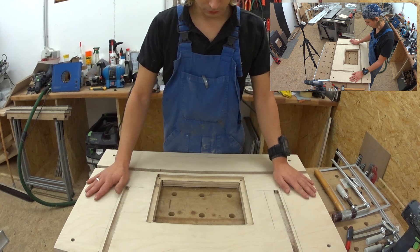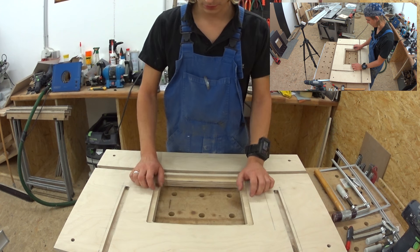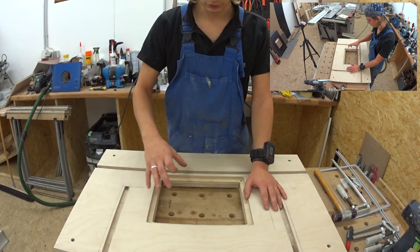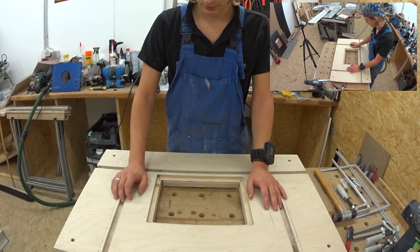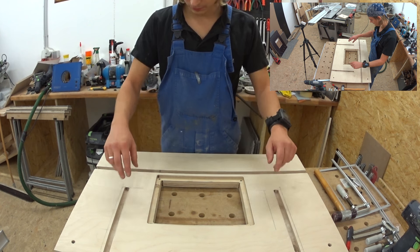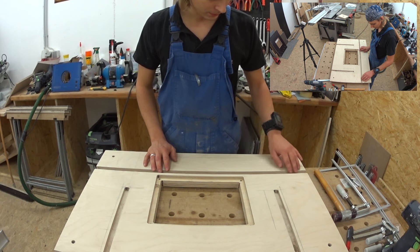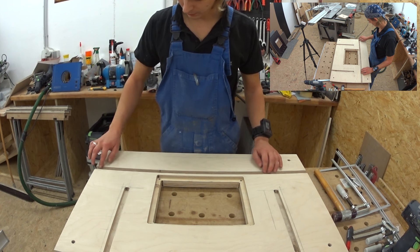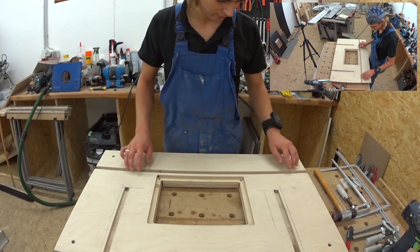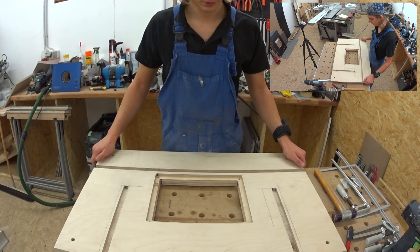So that's done. The mounting angles are in the correct place, so all you have to do for the router lift itself is just put it in there, align it with the set screws and screw it down. It wasn't that necessary to do this with the MFS, but you know me — I like this attention to detail. So now the next thing is I want to install the T-slot, but before I do this I take my bevel router bit and deburr all these edges and give a nice bevel on all the routed corners and on the outlines. It will give it a nicer look.